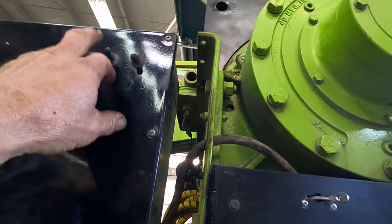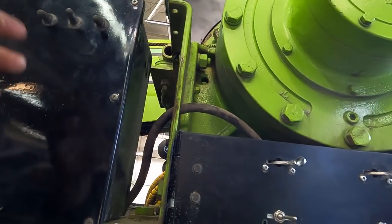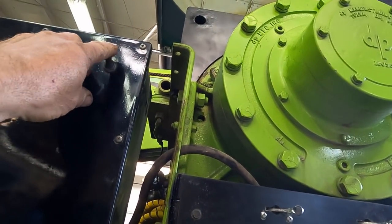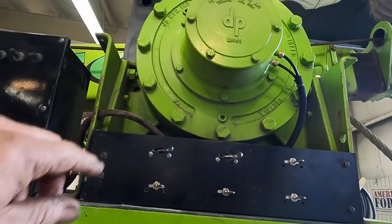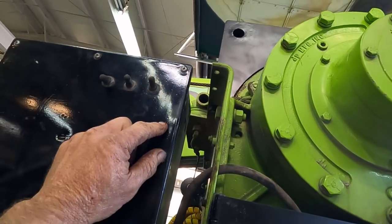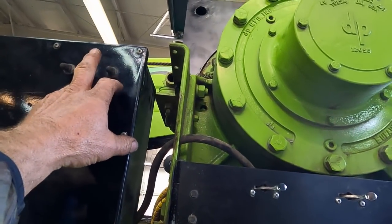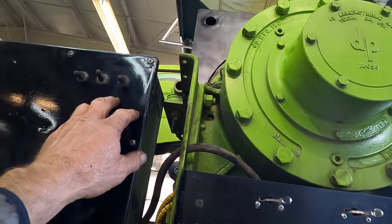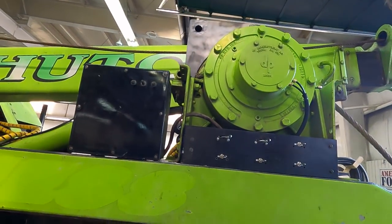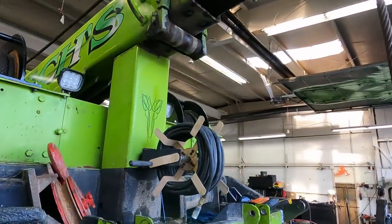This was the high idle control for the machine, and this one — you push it and there's a horn. Not really just for fun; it's also for signaling if you need to signal somebody. And this switch makes it so that the two rear winches will go at double speed, so you've got normal speed or slow speed, then fast speed. I've got them all working — this one handles both winches. As soon as I can find another switch I'll put one in here, probably move the switch down, so you can control the back winches' speed independently.